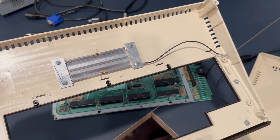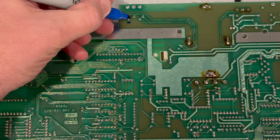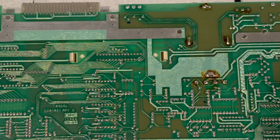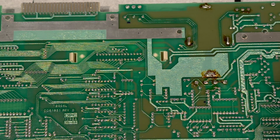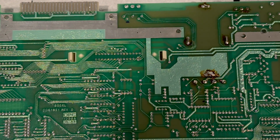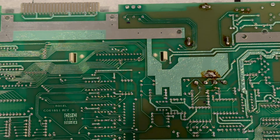I'll come back with a clean case in the next few minutes. Looking at this 800XL backside of the board in order to perform the S-video mod, I need to connect this pin here — the video output — to this pin here. Now that they're marked, I'll get stuff ready in order to perform the soldering. We got this nice piece of wire right here. I need to get my eyes on — my magnifying goggles, as Chris Edwards would call it, his helmet of goober. It just helps to be able to see things just a little bit better.